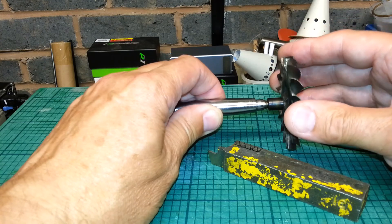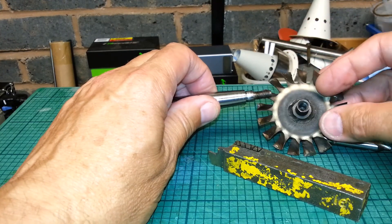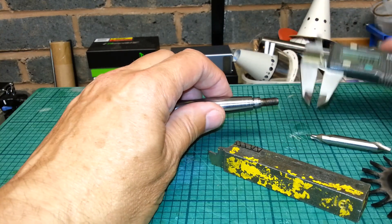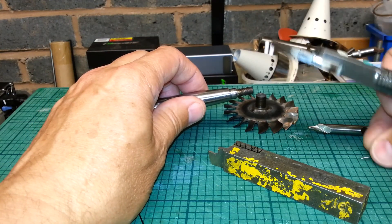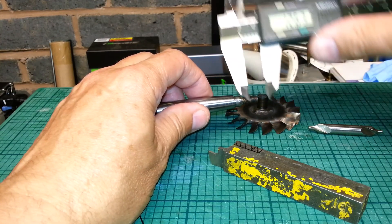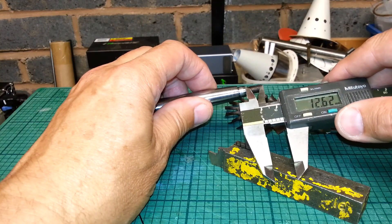What I suggest you do then is take the turbine wheel off again while it's still in the lathe — still set up. The length of this is too long; the thread's too long. When you measure this, I think it's twelve and a half — the ball bearing is in there. Twelve and a half, and the threads are near enough that.